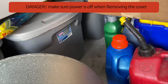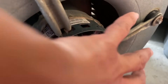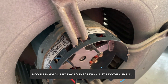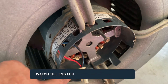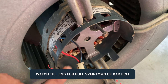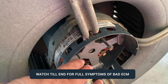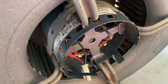This unit has an ECM, so I removed the module. These motors have the module at the back side. I know the motor is good - sometimes the motor doesn't run at all, or it runs at full speed, or it runs at slow speed. In my case it was running at slow speed. I had a case before where it was running at full blast speed, also caused by a bad module. In this one it's constantly running at slow speed, so I know my module is bad.